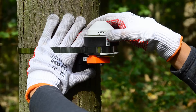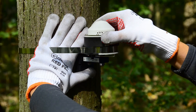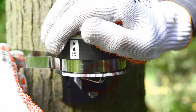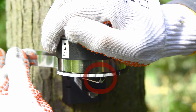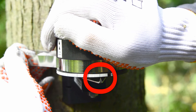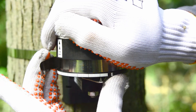Remove the initial tension tool by turning the sensor head a little bit counterclockwise and let the tool fall down, but hold the sensor head at all times. Set the sensor head so that the arrow points approximately to 10 millimeters of the range. This will give space for possible shrinkage of the stem.